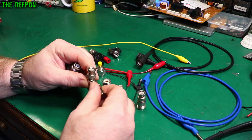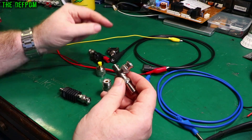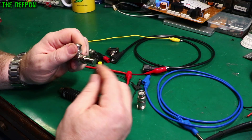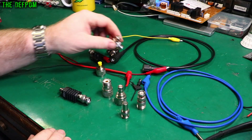You'd use a T-connector, put a terminator on there, and then have a BNC cable hooked up to whatever you're generating, to see what's going on and get correct voltage measurements. Because if you don't put the load on it, you'll get impedance mismatches and ringing in the cable and all sorts of problems.